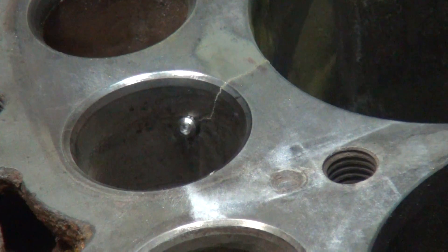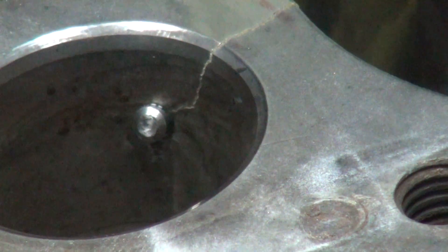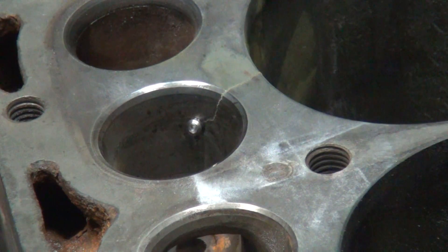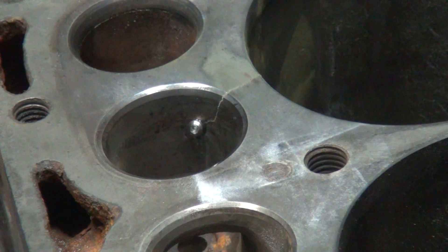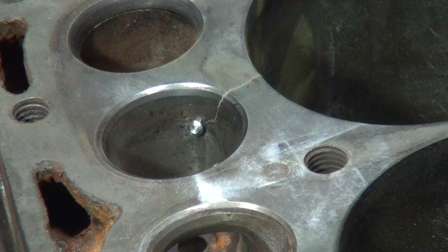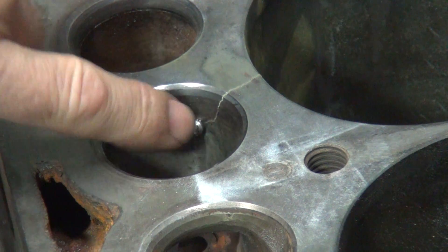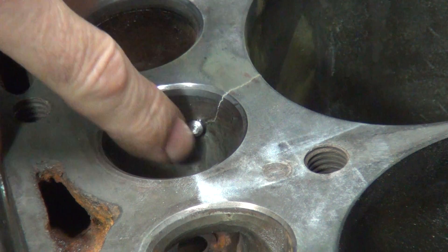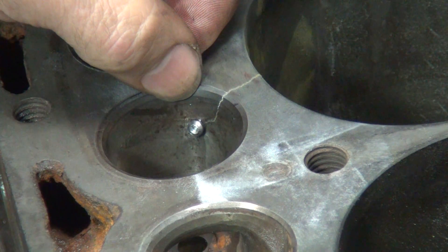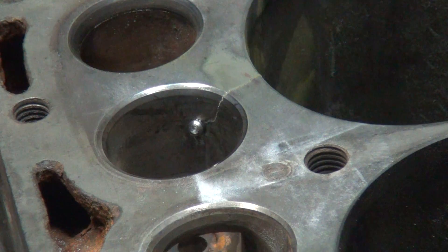How'd that look? Can you see in there? So there's the broken off pin down in there now — that's now locked in. So we're going to put a drill right next to that, follow that crack up the line, keep on it. I think I'm going to have to grind that away a little bit in there too, probably wouldn't hurt. So we'll go ahead and cut that back a little bit.